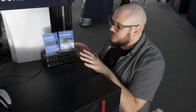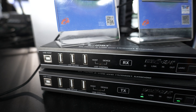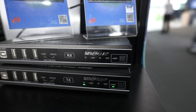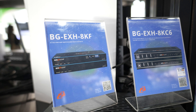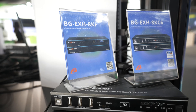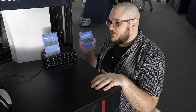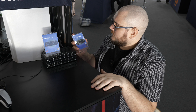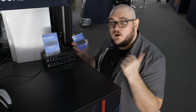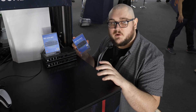So we're down here taking a look at these two units right here. What we actually have displayed here is this unit right here, the BGEXH 8K C6. What this is, is an 8K HDMI and USB over HD-BaseT extender. That means you're going to be able to take basically pretty much uncompressed signal through a CAT cable and transmit not only your HDMI signal, but now your USB. And on top of that, you're going to get IR, EARC, POC, RS-232 — all of that really cool stuff with this unit right here.